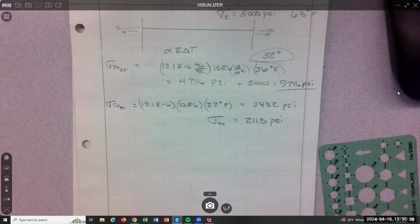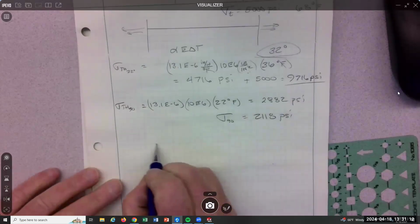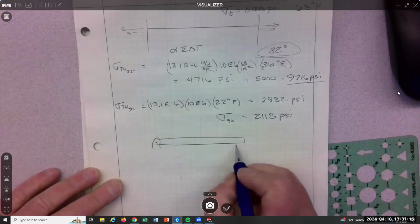So you got a little more than you needed, right? And that's gonna develop stress because of the rigid supports. If the temperature goes up or down with two rigid supports, you're definitely developing stresses. That's why we try not to have rigid supports, and why we've always had a pin and a roller. A pin and a roller will allow that beam to expand and contract with temperature. So that's usually what we want to happen. Just remember, all our beams are pin and roller.